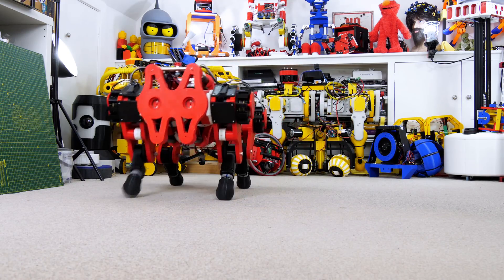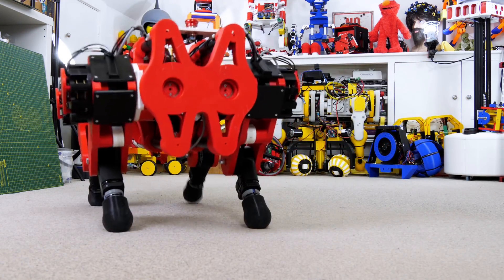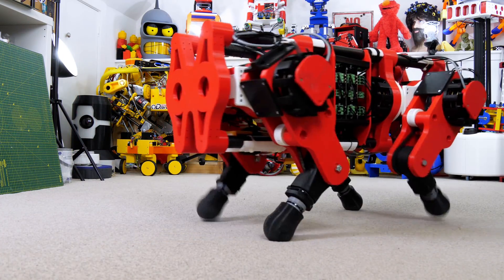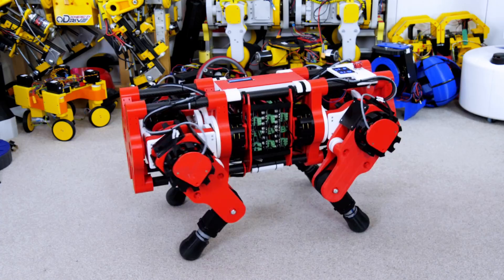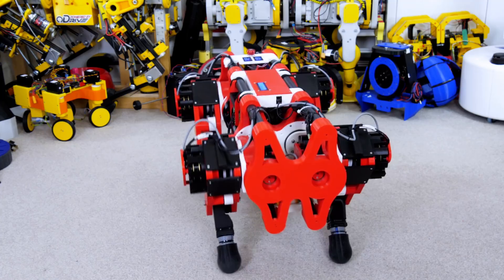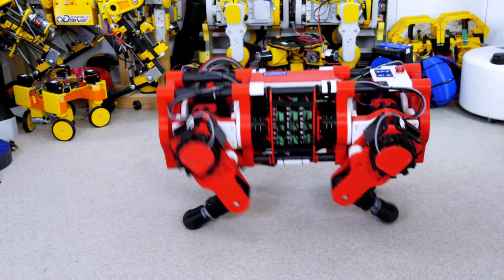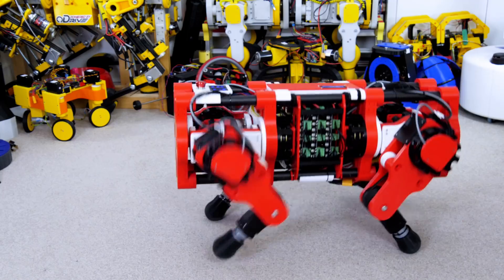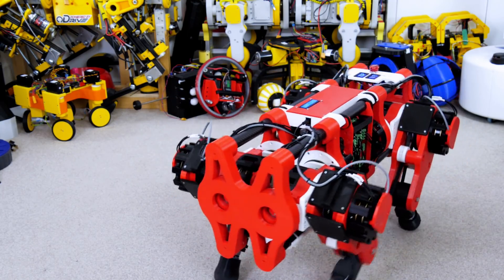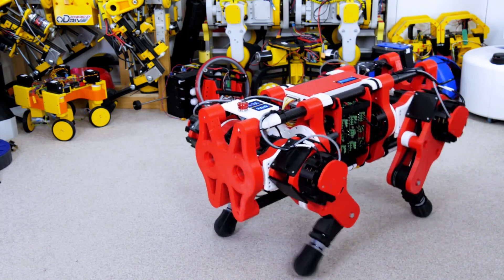The steps are currently quite short and fast so the whole thing hangs together just right. If I overdo the moves and try to move the feet too far then we break the coefficient of the system and some non-ideal things start to happen, mostly because the capabilities of the virtual spring absorbing force in the legs no longer matches the forces exerted on it, since the motor driver parameters are constant. The dynamics of the robot are something I'll be working on in future videos in this series.